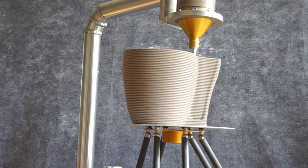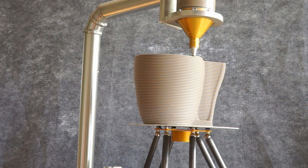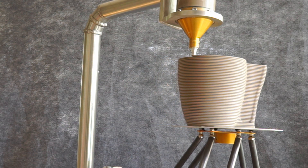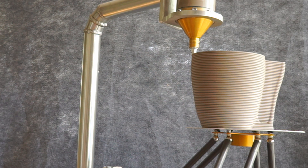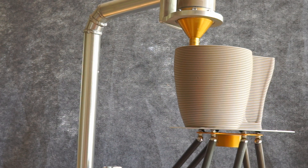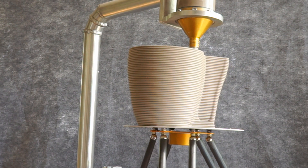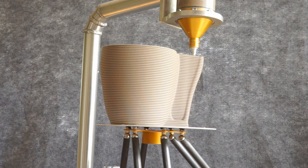The other thought is, well, you can use a hose. Yes and no. I did a lot of research with the hose and trying to get that to actually work properly, but the problem with the hose is that it inherently has a tremendous amount of friction, which means your pressures have to go up. And it's not stable in dimension — the hose actually expands with pressure. So when you come off the throttle and the stepper motor stops, there's still residual pressure in the hose that has to be relieved, which means it's going to ooze substantially. So the configuration we have here of the stationary very short nozzle coming out of the end of the extruder works exceptionally well.